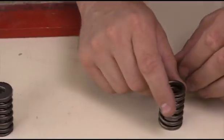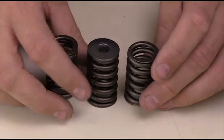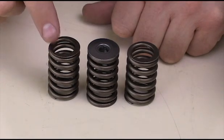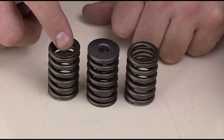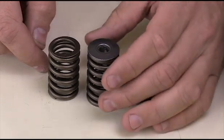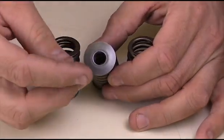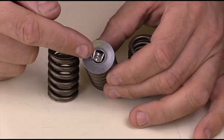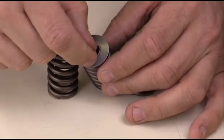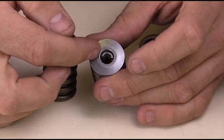I have a couple of springs here taken out of a cylinder head. There are a lot of different variations — some that aren't square-shouldered like this and have a taper to them, meant to provide a different amount of force during different positions of the valve application. We may also have a condition where there's a spring on the interior and one on the exterior to return the valve to the closed position at an appropriate level. The springs are retained in position by a spring retainer on top that sits inside the spring itself. There's a keeper — two halves — and the little groove inside the keeper is retained against the valve itself. They are tapered so they sit down inside both halves of the plate and hold the spring in position.